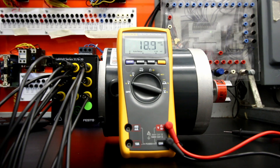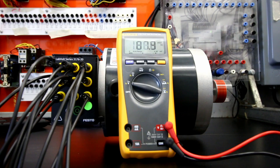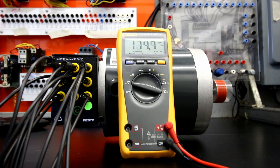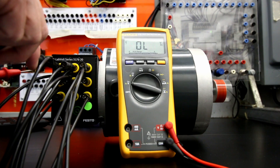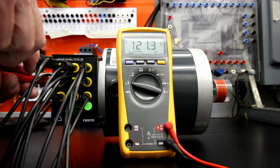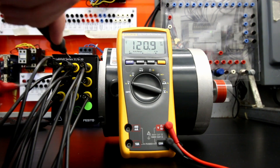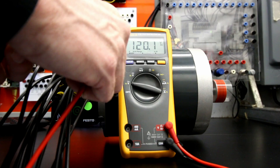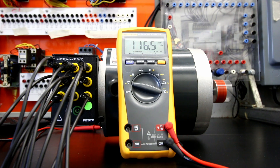Ready to rock — let's juice this up. That motor is silent, you can barely hear it. We've got that four-pole motor running at 1,725 RPM. Now let's look at the voltage on each winding. We have 208 volts as the source. Across T1 and T4, there's 120 volts. Across T2 and T5 — 120 volts. Across T3 and T6 — 120 volts as well. So that's our lower voltage connection: 208 volts supplied, 120 volts on each winding, running at rated horsepower.